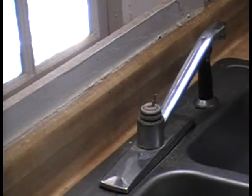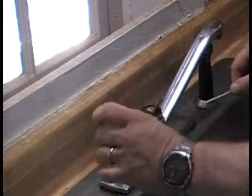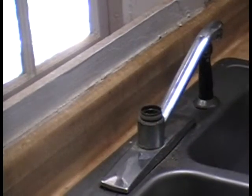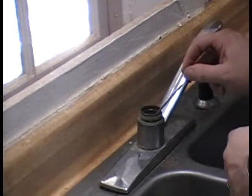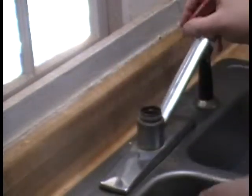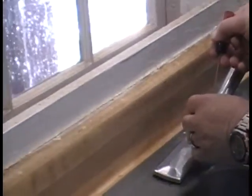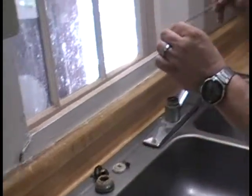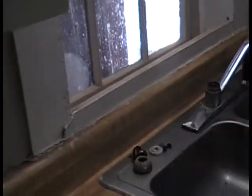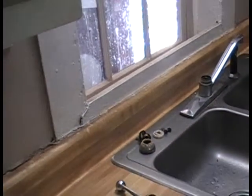With the ball and washers out, we inspect the parts. One of the springs is cracked — split right down the side, or has a big chunk out of it — which lets water through. So even if the cap had been in the correct position, it would probably have still been leaking, just maybe not as heavy a stream. This thing was pretty much beyond serviceable.